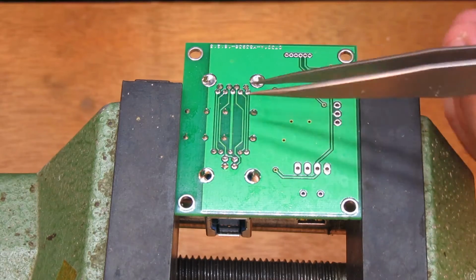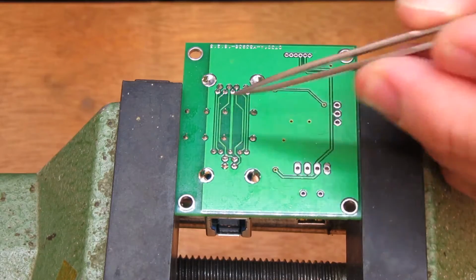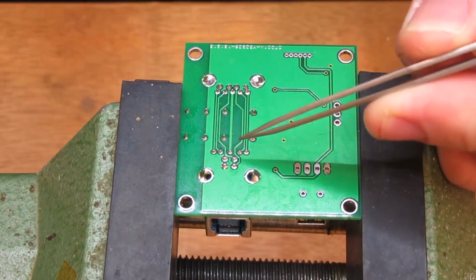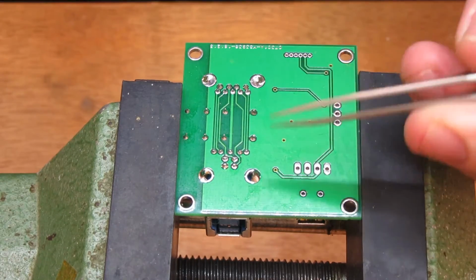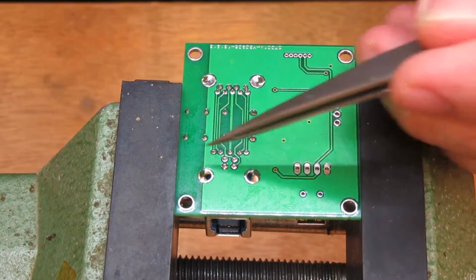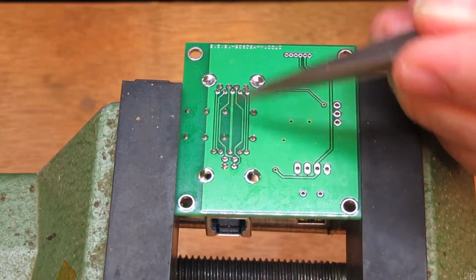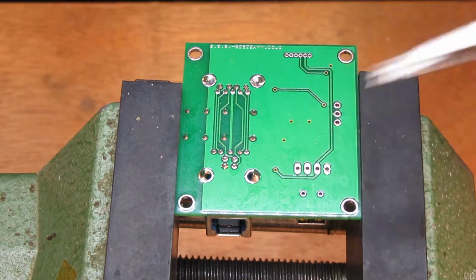The problem was with my Eagle software circuit board parts, I mixed up the type A and type B using the same schematic outline. So as a consequence, they didn't have different configuration. So as a result I did these in parallel, when in reality it's meant to be crossed over.